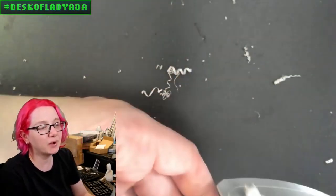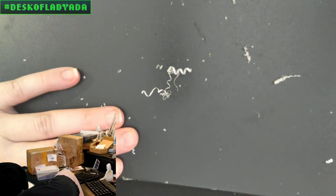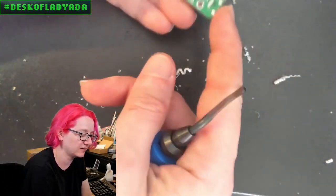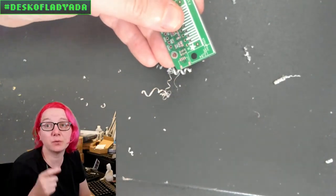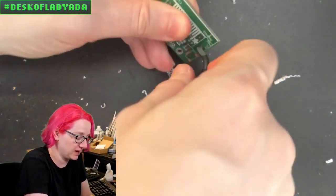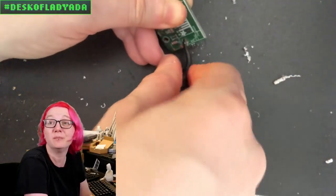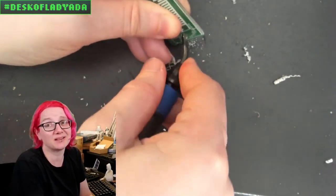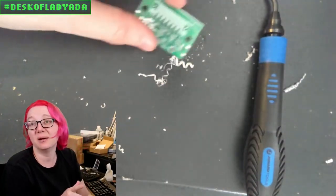And then finally, not recommended, but something I do. Again, if you're doing this, make sure that you are doing it with a vacuum or over a trash can. If you have a hole, like I had holes in my PCBs that were mounting holes that were too small, you can go in and very carefully either countersink them or enlarge them. Not what it's supposed to do. It's not meant for fiberglass. And of course, you want to clean up the fiberglass dust real well. But I have done it. It works, of course, better on paper phenolic. For paper phenolic, it works great.